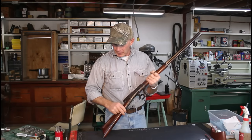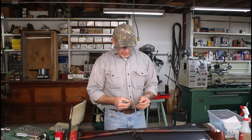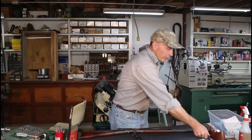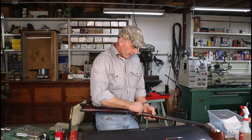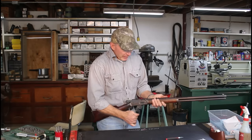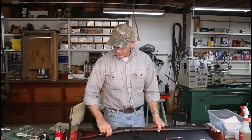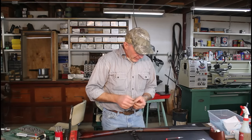There's a simple trick — it's not super scientific, but it involves Scotch tape. Scotch tape is about two-thousandths of an inch thick. I put enough layers of Scotch tape on the field gauge and trimmed them up so it wouldn't close all the way. I ended up with seven layers and it didn't quite close. When I miked it, we ended up with 15 thousandths excess headspace — we actually gained a thousandth with our seven layers. So that's well beyond maximum safe headspace, and we do need to fix this thing up.